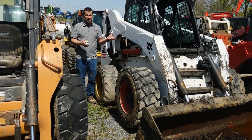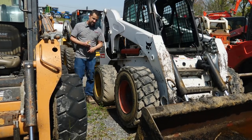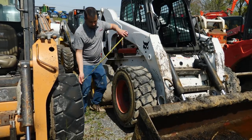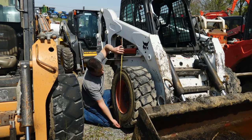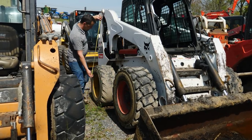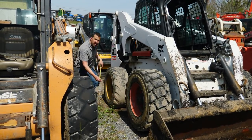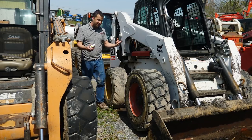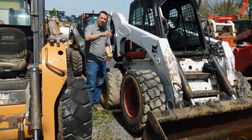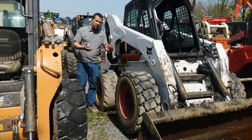Beside me here is a very real-world example of a machine that was run exactly like this. This is a Bobcat skid steer that we had traded in. Ideally I'd be able to do a circumference here, but my tape measure is just not behaving. If we measure this tire top to bottom, we're at 32 inches from the bottom of that tire to the top, and going across this one right here, we're at 30 inches. We have a two-inch difference in height of the tire. More than likely, that's going to be about a three to four-inch difference in circumference as that tire is rolling, and that's going to cause that undue wear.